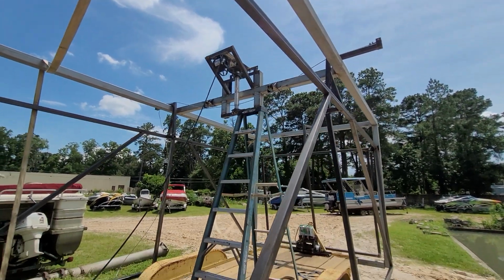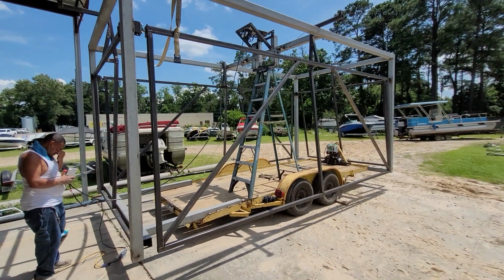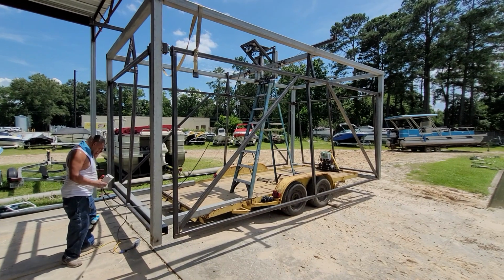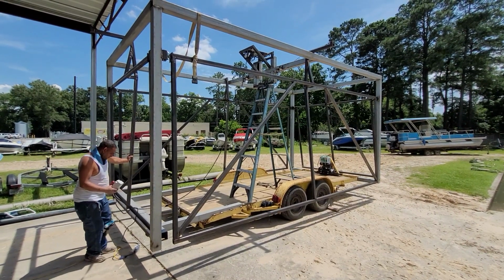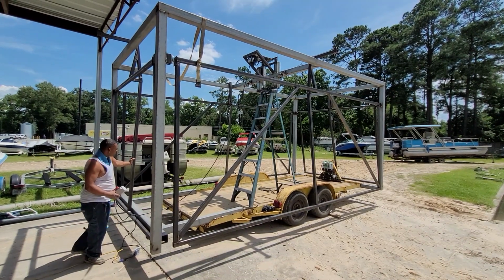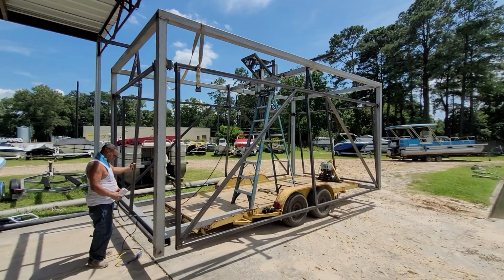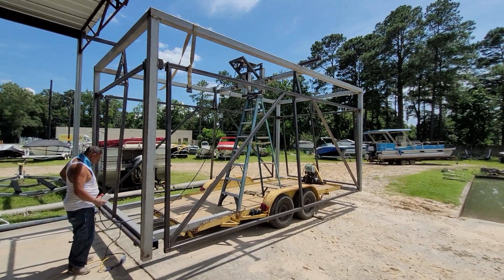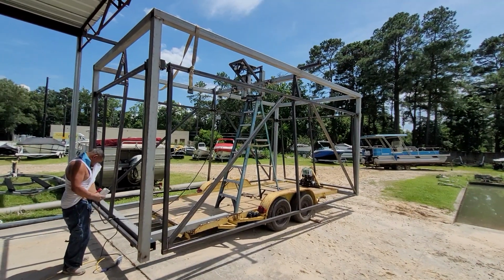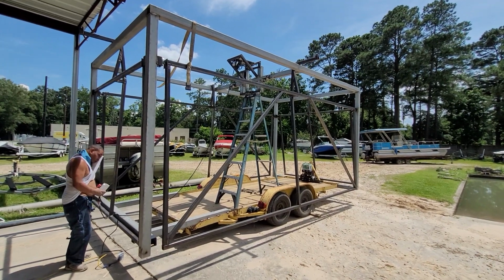And these doors are pretty heavy like they are, probably a couple hundred pounds or more. Probably about 250 pounds a piece, these big doors. And once you dress them, it could be 700 pounds or so, depending on what you put on there. We're thinking about doing some aluminum siding to keep it light and some grass on the inside, like I said. So they shouldn't be much heavier. That boat lift winch up there is rated at 4,500 pounds per pull, combined. So that would give us 1,200 pounds per door we could lift.